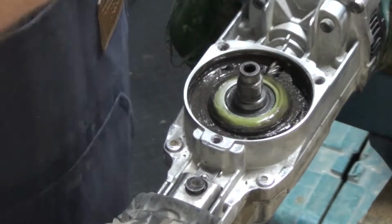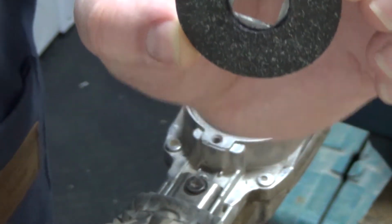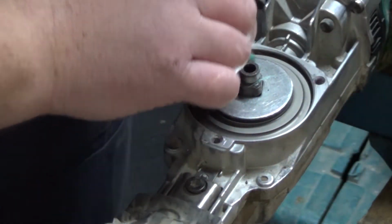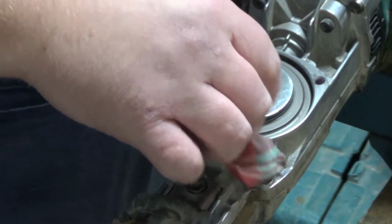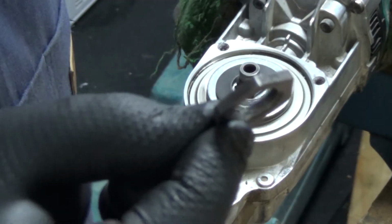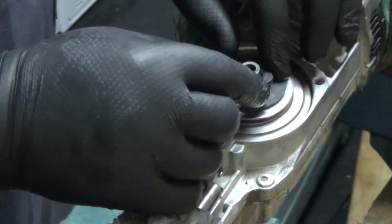I'm going to take my gloves off and pick up these pieces with my bare hands so that I don't contaminate them with grease. And then this much cleaner looking friction plate going back on the top. With that in place, I'm just going to give another little wipe around the edges of that with my thinners, around the middle. Very good. Then it's the washer that points upwards, followed by the lock nut, and that collar around the inside obviously locates the washer. Just realised that, got my hands in front of the picture.